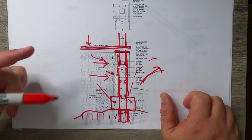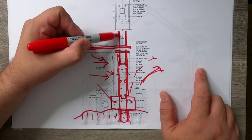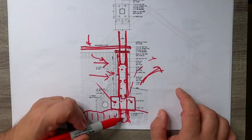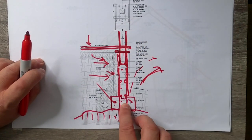We come back and look at that series of connections on the right side where we have that ledge stone. Basically what we're trying to do is give this column - which goes down to there - really strong feet. It's like I explained when we were out there: if you were just standing there and someone tried to push you over, you might fall over pretty easily. But if you had a way to stick spikes at the bottom of your shoe and go down into the ground 18 inches, your stiffness or lateral stability would greatly increase. By going all the way down and connecting to the rock, we're making this a very stiff column through this series of connections.